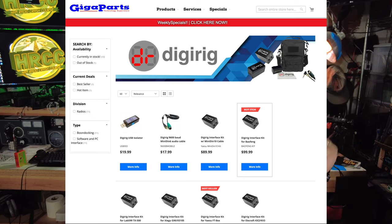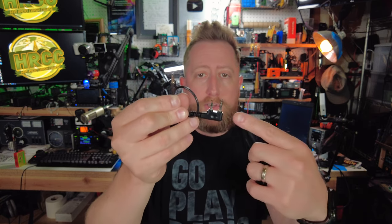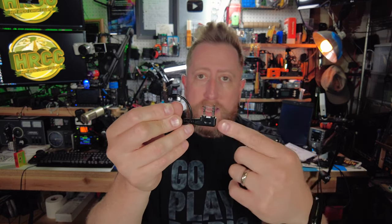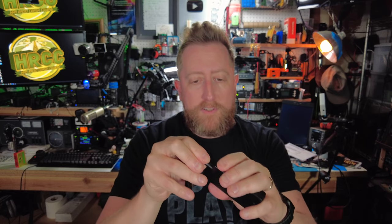The best option is going to be the DigiRig, which you can get at Gigaparts. Link will be in the description to check that out. And just use your Baofeng, basically. Same connector, same wire here is going to go to your Baofeng, same Kenwood connector, and into the DigiRig. That will allow you to do all kinds of fun stuff, not just data, audio over your DigiRig, but you can also do serial data, which would allow you to program your radio. Yeah, that's a capability.